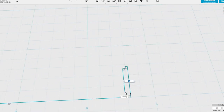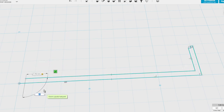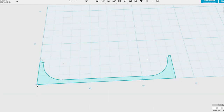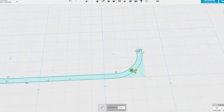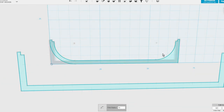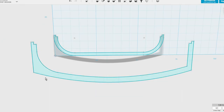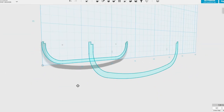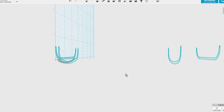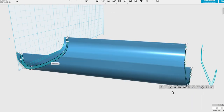So I'm using 123Design — it's an old Autodesk program. I just know how to use it and I'm too stubborn to learn anything else. We start off by doing a 2D sketch — just lines — and set the basic shape up. I do a tester and then work out the shapes I want for the various stages down the base of the joystick. It has the bulge, and then the point at the end where the buttons go.